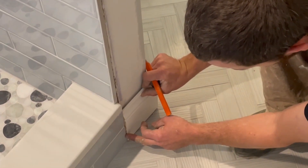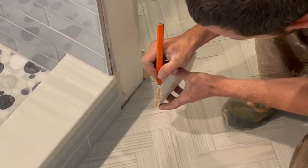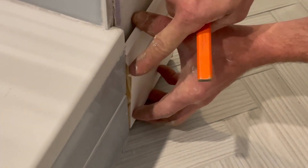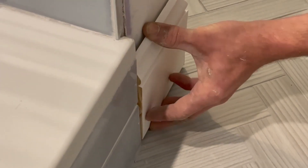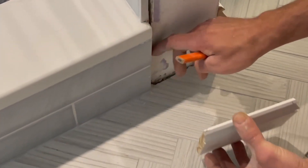What I'm going to do is cut this on an angle, going this way, so that I don't have as big of a gap. I can go back into that corner more and my front side will be facing out at more of an angle. If you see the gap there — because the back side has thinset on it, I don't feel like ripping the thinset off and trying to do all that.